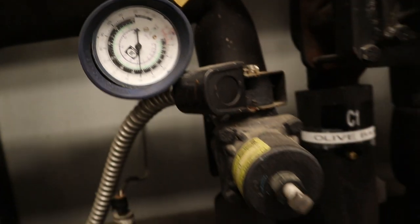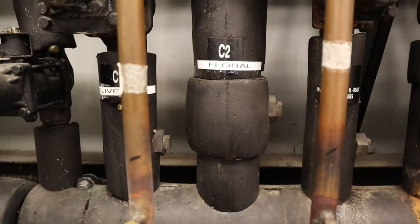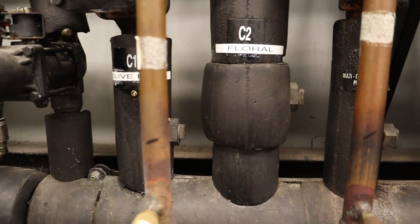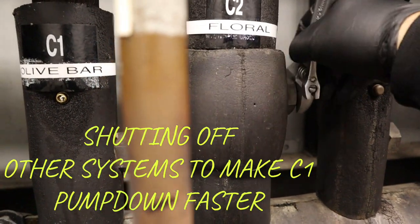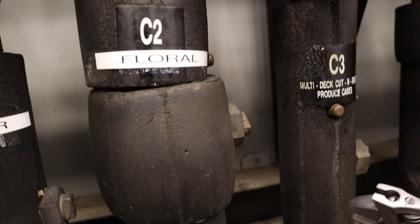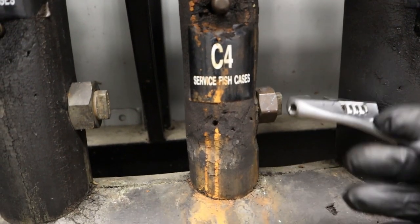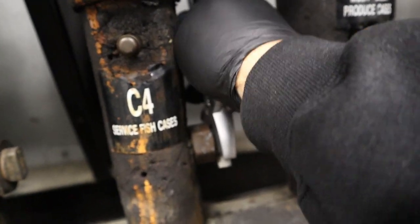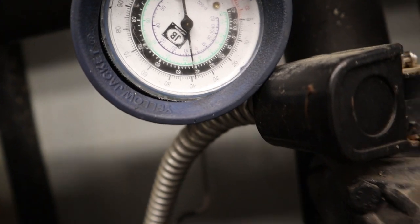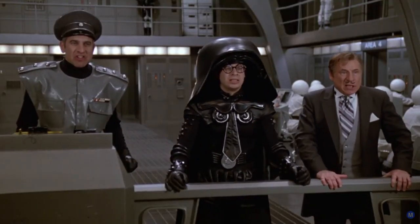Suction pressure dropping to 40 and my liquid pressure is now at 55 still — I need to make this go faster. The way I do that is I shut off other systems to make C1 go faster. I only did about two to three systems. Now I'm around 38 pounds and still 55 — come on compressors, suck!